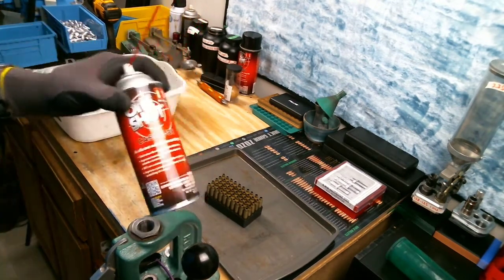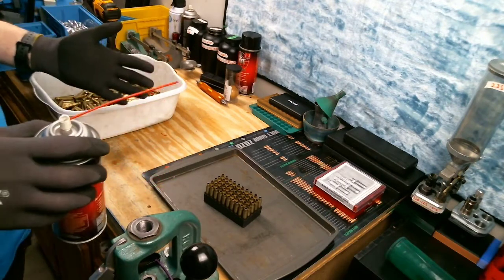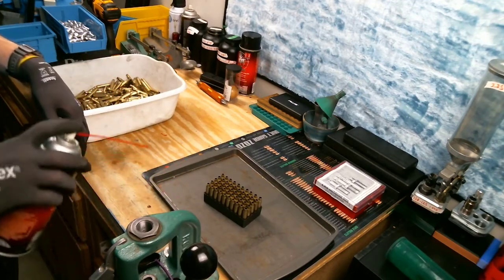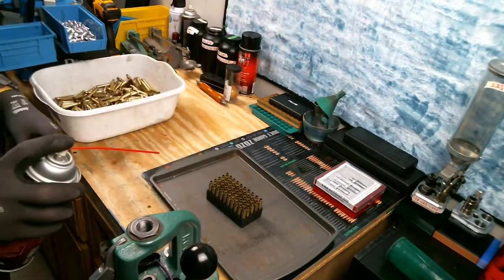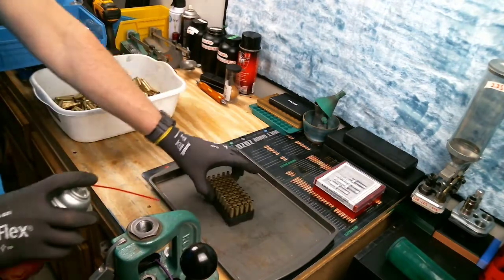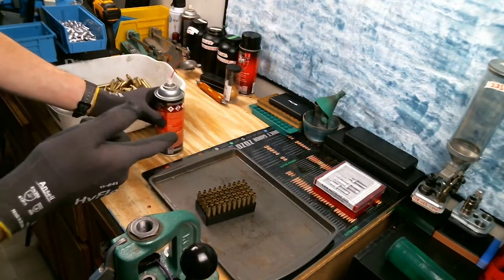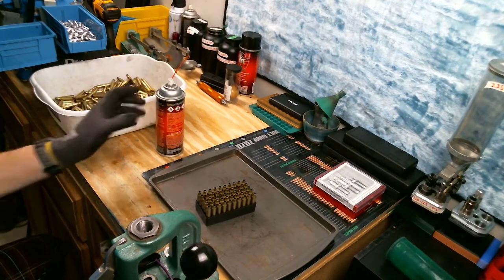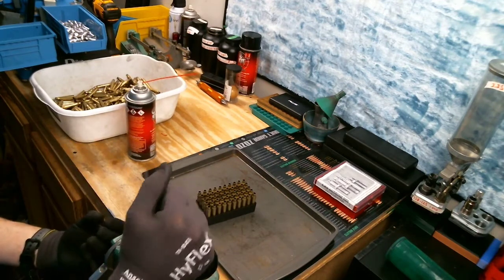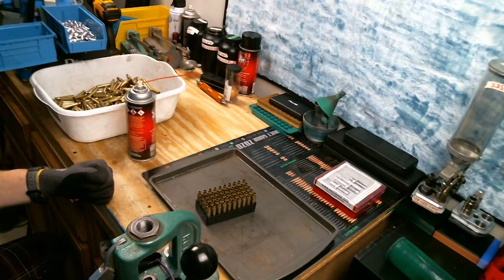Here's our bottle of Hornady One Shot - give it a good shake. I'm pretty much empty here but I've got a spare one in the back. It doesn't take a whole lot, but you can go to town on it as long as it's not dripping wet. Hold it at sort of a 45-degree angle and hit it from all four sides, going up and down, turning it, hitting it from every side. Make sure you get it at an angle to go inside your necks, because a lot of people have issues resizing their .223 specifically - they don't get enough lube in their necks. That's their problem, because with your stroke it's either going to rip off your rim or it'll just totally stick.